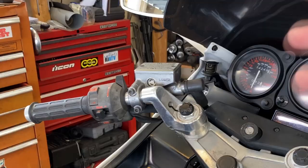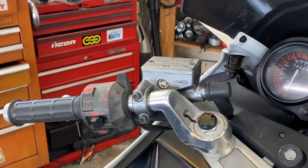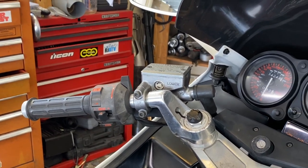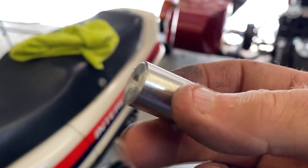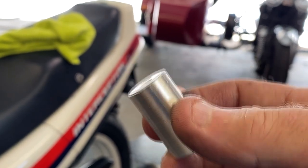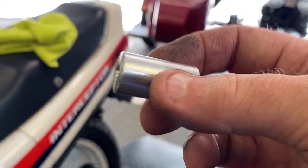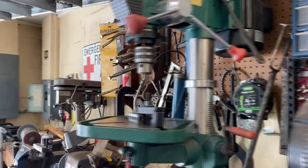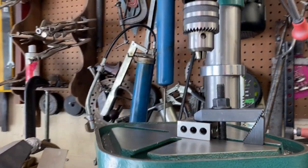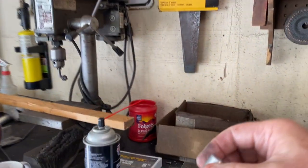This does need to be rebuilt — it was just a mistake on my part for not ordering the rebuild kit when I did the front and the calipers and all that stuff. But it was working before, so it works for now. If I was going to go out of state or take a ride up in the mountains, I would definitely rebuild it first as good practice. Those are the 18 millimeter sight glass kits — you can find them in a variety of sources; I'll put a link in the description. This was definitely worthwhile to make a special tool to put this in with. But using that drill press to push it in was definitely in the dumb category. You don't need to do this — pop it in a vise, secure it, take whatever you're going to use to drive it in, and tappy-tap-tap and it'll go right in.